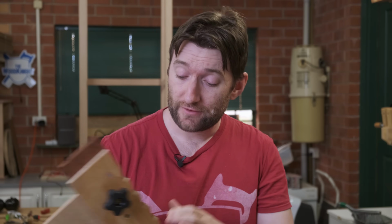I mentioned I made a mistake on this, and I actually made a couple of mistakes. First was on the template holder, I was just winging the spacing. I should have had the spacing on this line up with 1 or perhaps 2 of the Sawtooth. Instead, I've just gone for 50mm spacing or 2-inch spacing, which is incorrect. I'll have an updated template, and off camera I'll build a new sled just so that it works.